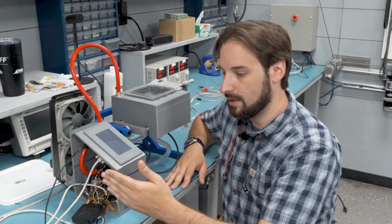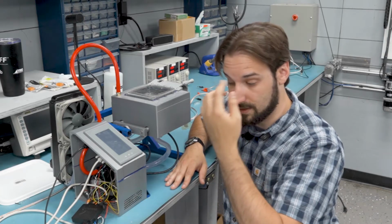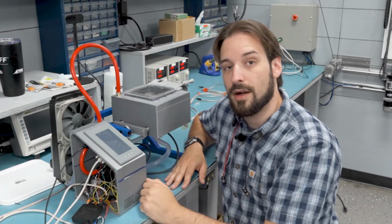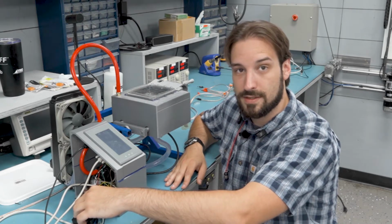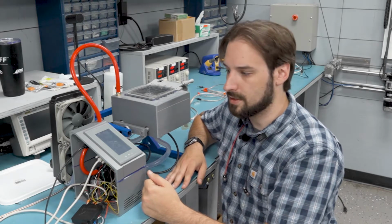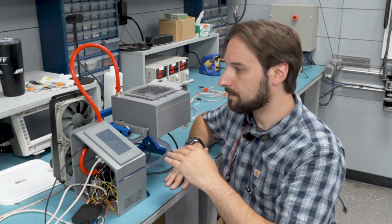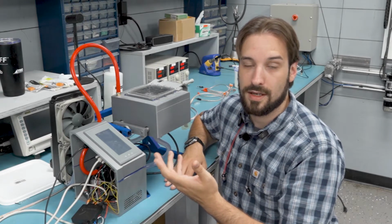And really all I'm doing in the enclosure is changing a couple of different voltages because I need 5 volts for some things. And then I'm going to be running signals from the PLC into what are called H-bridge motor drivers, because most of everything we have to control on here is either a motor or just needs a constant voltage or something.